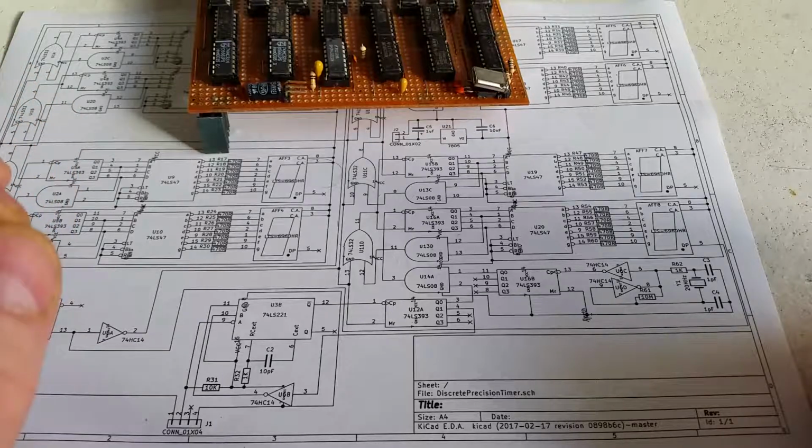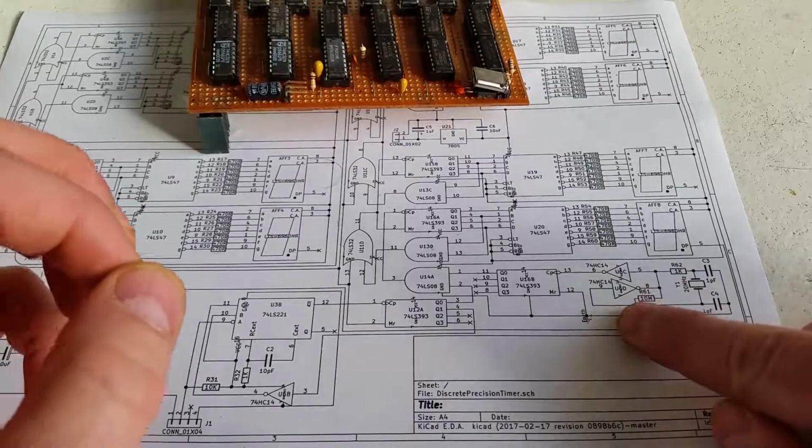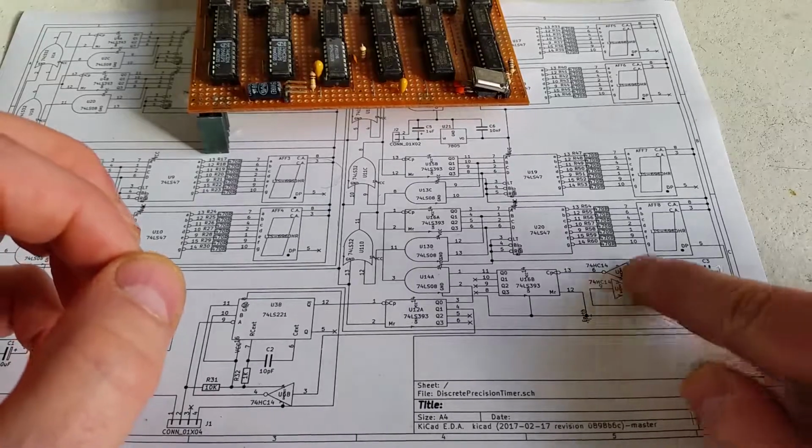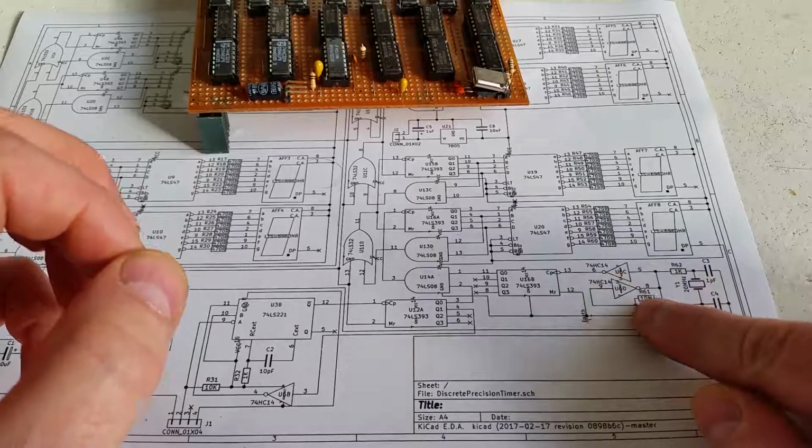But when it starts to drop back down to 0, it will drop back down very rapidly, and then it will again do the same, in that when it goes back to 1, it will go very slowly at first and then very suddenly. That reduces noise and it increases the accuracy of the actual crystal driver. So if you're going to build one of these crystal circuits, you definitely need the CMOS version of a Schmitt inverter circuit.